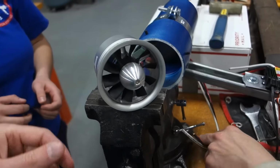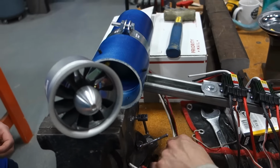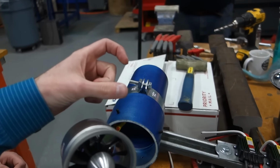It's a three-phase motor. Not a whole lot for a service loop in there. Not with this gauge. Just fold up a little bit. Go like 3 inches forward, 3 inches back. Fold it over. You'll be fine. That's all you need.